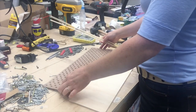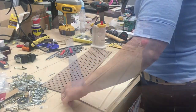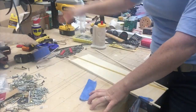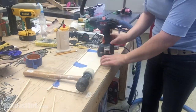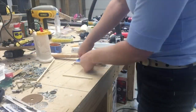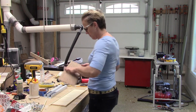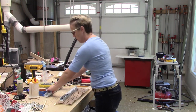These pieces are super small and I don't have any nails that are short enough — I have a 23-gauge pin nailer, but not short enough nails. So I used glue and tape and whatever odd things I had within arm's reach to weight the pieces down until the glue dried. I glued them around the perimeter and then glued the top piece on. I didn't worry about making the pieces the exact right size because I just trimmed it up later.